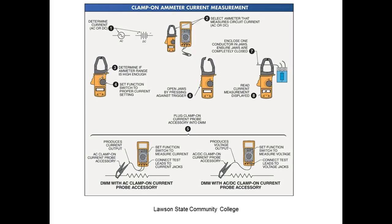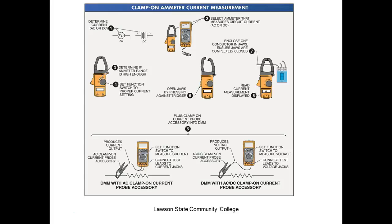Are we okay? No, but it gives you a scale. It would say, okay, if it's on a 10-volt scale, then every volt would equal 1 amp or something like that. So if they come up and measured 1 volt, you would know it would actually be what? 1 amp. That answer your question, Joe? Makes sense? Yeah, we used to have one of those around here.